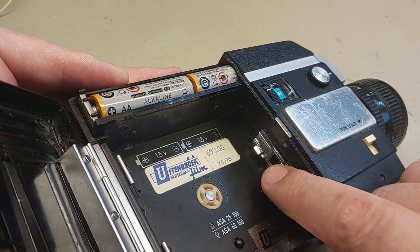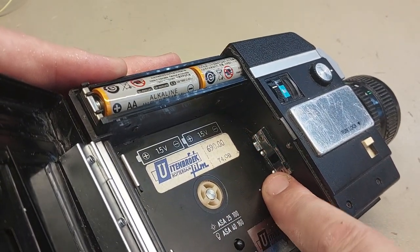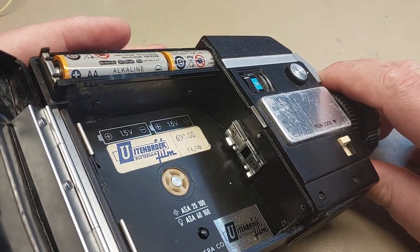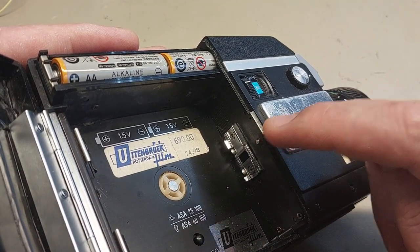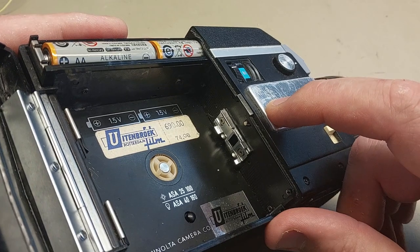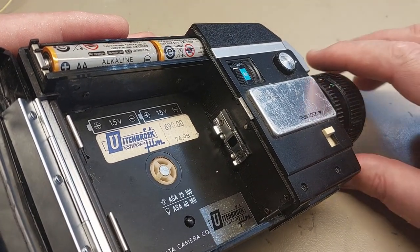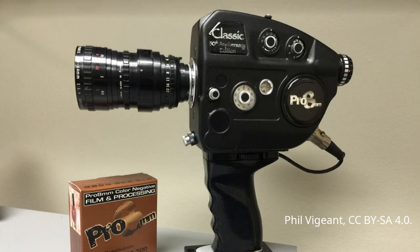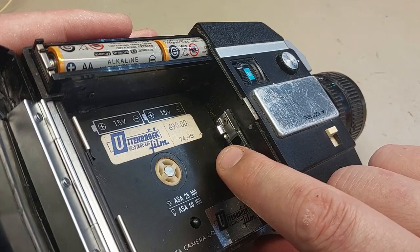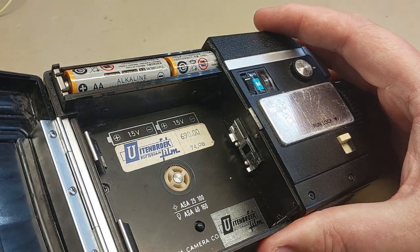To get the sensor into the focal plane I would have to remove the metal half of the Super 8 film gate. There are various other projects on YouTube that have done just that and that's how they've made their ones work. But my absolute line in the sand for this project is it's got to work with an unmodified Super 8 camera. It's one thing to take a near worthless broken Super 8 camera from a second hand store and remove the film gate, but there are some very expensive Super 8 cameras owned by collectors and filmmakers who would not want to modify their cameras. So I have to come up with a way that doesn't involve trying to put a Raspberry Pi sensor in the focal plane of the camera.